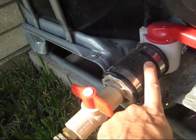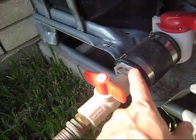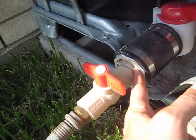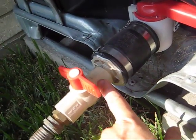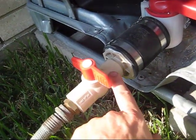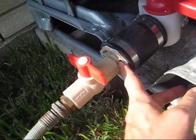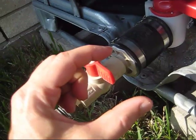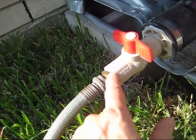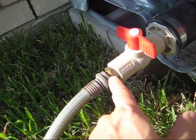I get this at Home Depot in the plumbing department — you get all these things in the plumbing department. So I've got a 2-inch connector, then a 2-inch to 3-quarter-inch conversion that is threaded inside. This part here is called a compact ball valve — it's 3-quarter-inch. Between the compact ball valve and the reducer is also a threaded 3-quarter-inch PVC nipple, about this long — you can just buy one piece like that.